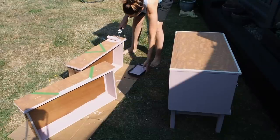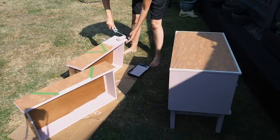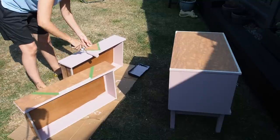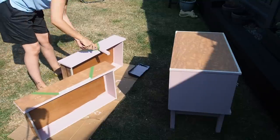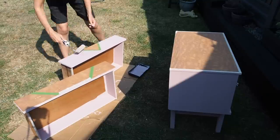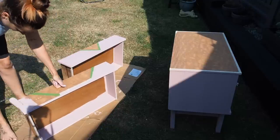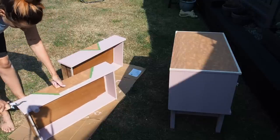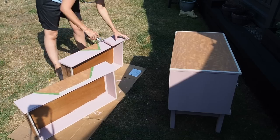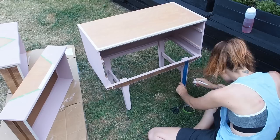Then the other fun job was painting the front of the drawers. I was really careful with my foam roller not to go onto the design — I want to keep where I've masked completely paint free because that's going to be the lovely wood section. You want your roller to overlap the masking tape and make sure there's plenty of paint along it so when you peel it off you've got a solid line. Thin coats are much better than slapping it all on in one go, so I did three very light coats with a roller and a sand in between each coat.